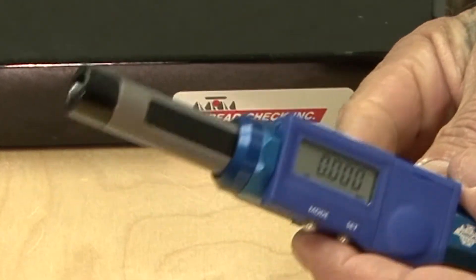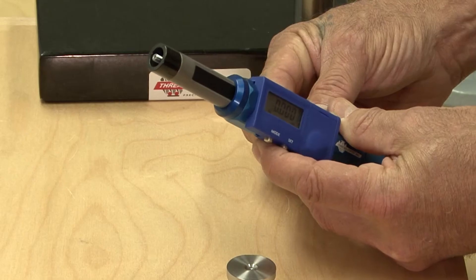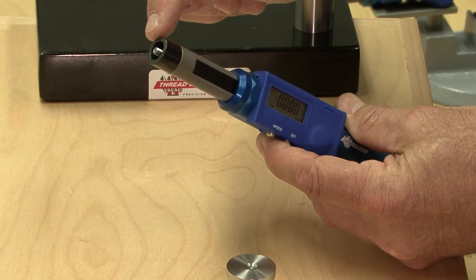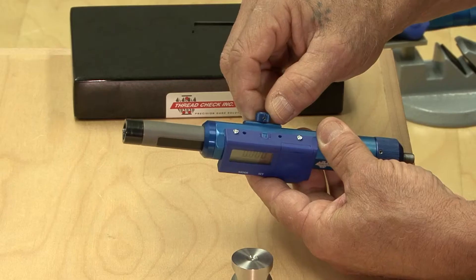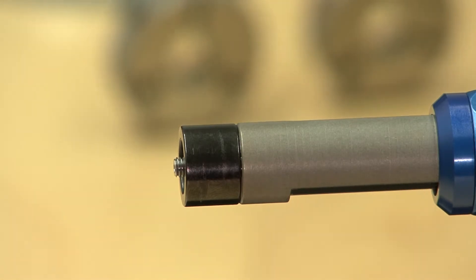The gauge at this point may be sticking out of the front of the sleeve or sitting behind the sleeve face. The front face of the encoder sleeve is where the reading from zero will take place. Relock the encoder sleeve once it is as far forward as it will travel.